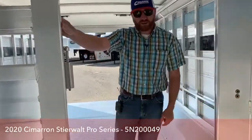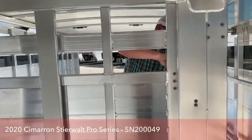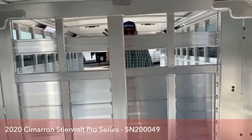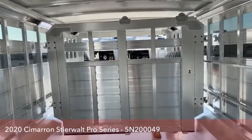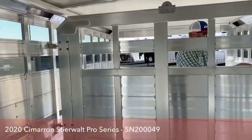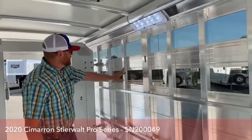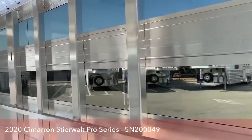On this one we put the slider with no threshold, so cattle don't have to step over anything loading and unloading. If you just stand in the middle, the gate is floating back on its own — we're on a slight slant so it naturally rolls. It's just very easy to use. On all your side posts they're a foot apart, so you can set that gate every foot on this trailer and manipulate stall sizes all you want.